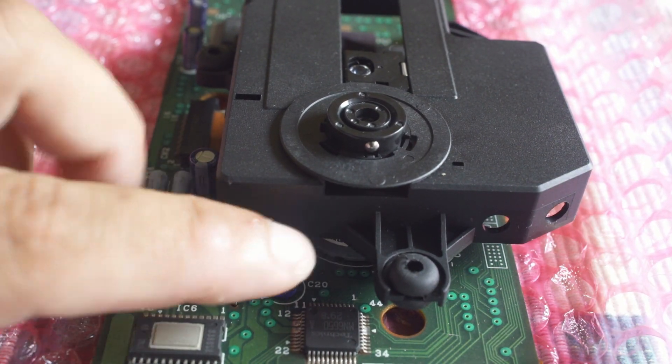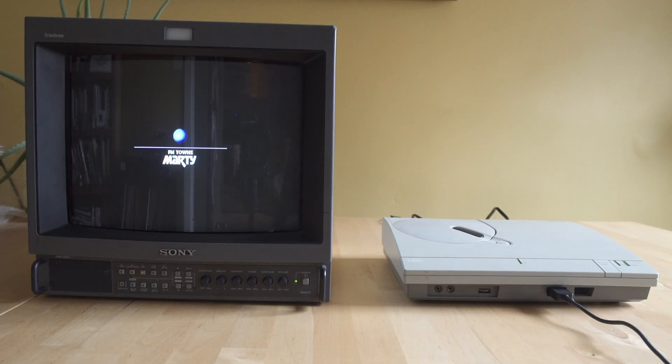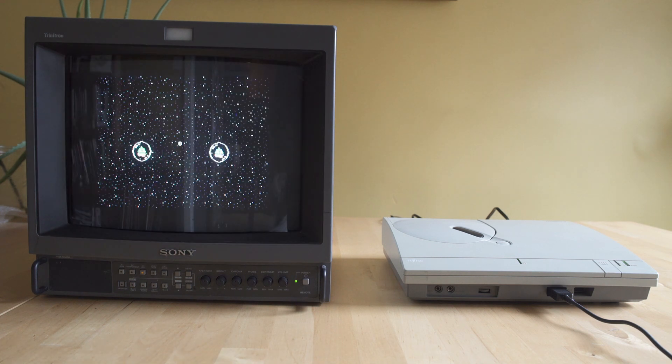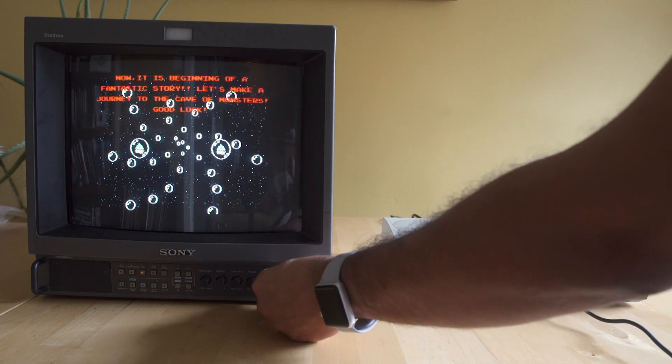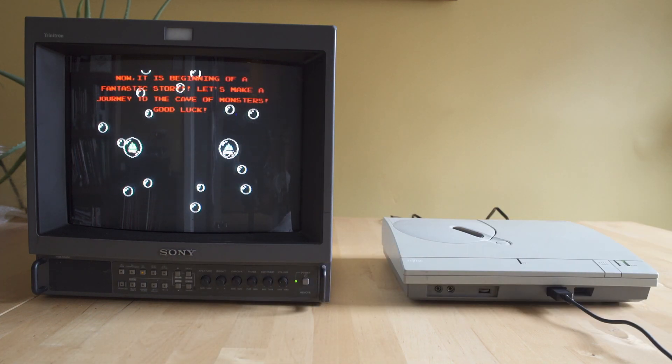Like I said, these may dry up. You may get some audio glitches, some fuzzy video. You'll see symptoms like really low audio when the capacitors start to go bad. But considering this is working perfectly fine and we've inspected the caps — nothing's bulging, nothing's leaking — we know at least that this is good to go for the near future.